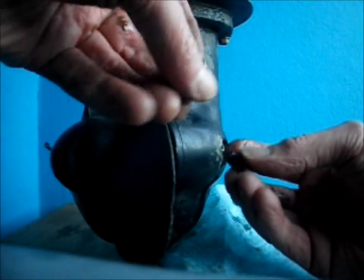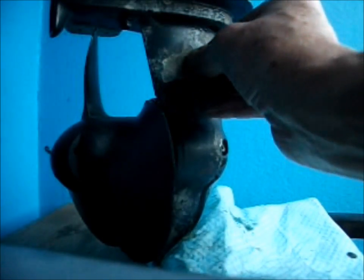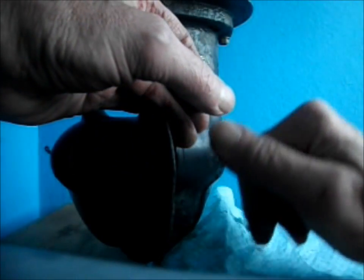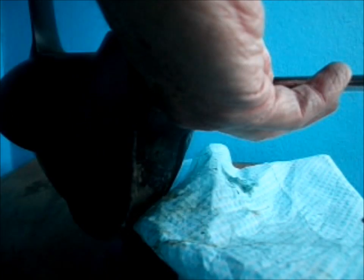I'll need to go back to this because it will need a top-up — it lost a few tablespoons of oil, but that's fine. Watch the sealing washers when you replace these drain plugs — you should replace the sealing washers each time you replace them; it's not worth taking the risk. So watch out for the third video, and bye for now — happy boating.